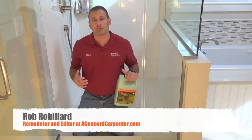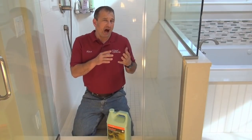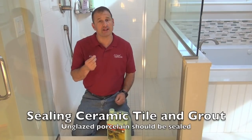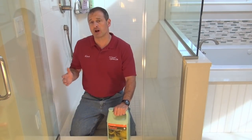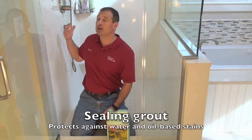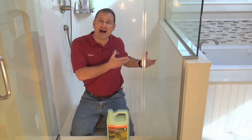We're back in the bathroom and we're going to be talking about using a grout and tile sealer. Grout and unglazed tile is porous and basically if it goes unsealed it will stain and darken — and it'll happen within six months to a year, guaranteed. The benefits, one of the main purposes of sealing tile and grout, is to keep it looking clean. It prevents against water and oil-based stains and discolorations. Body oils, all the chemicals and soaps that we use — they stain tile. Mold, mildew, showers get nasty, so anything we can do to keep the tile looking clean and nice longer is a plus.